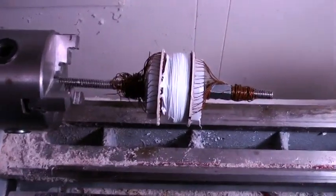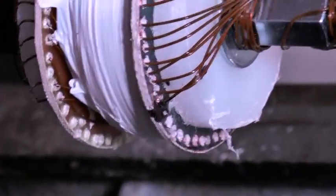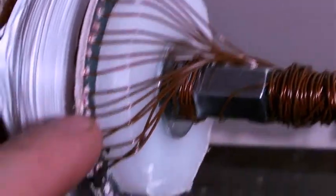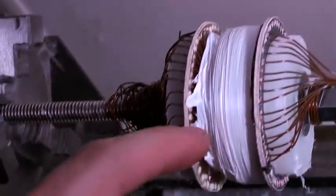Here's the coil I've been winding. You can see each layer has a separate winding - there's the first wire, second, and so forth. This is straight 24 gauge high temperature wire for motors, with insulation on it - magnet wire, actually motor wire, but it's being used as magnet wire.